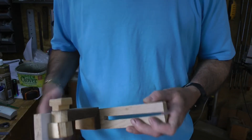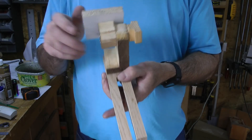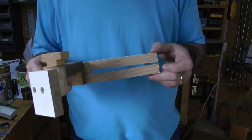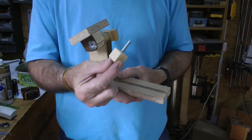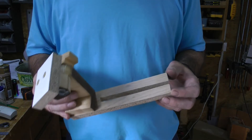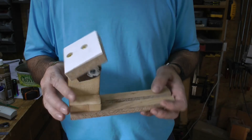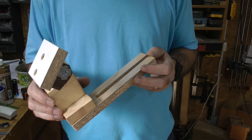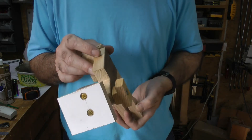What you've seen is probably at least version two. I did make an earlier version which is all in wood — it worked to a point, but what I didn't like was the flexing. It was just a knock-up held by a little thumb screw with an insert on the wooden base of the grinder. It was a bit clunky. When I realized I could use the steel plates on the side that were already bolted to the grinder, it just seemed to make more sense — but it's another alternative if somebody wants to go that way.